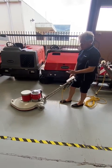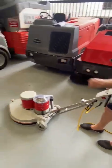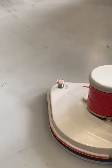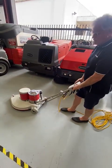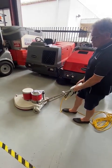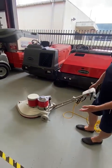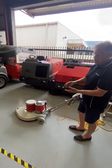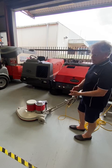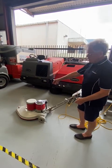To operate the machine, there's a couple of things — a switch up here, but also to adjust the pad pressure. The pad is adjusted when the machine is new. But you may need to adjust the pad pressure depending on the floor surface. Also, when the pad starts to wear and flattens down, you may need to put a bit more pad pressure, and certainly when you put a new pad on.